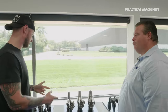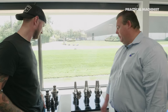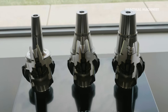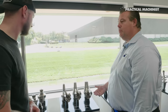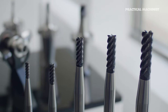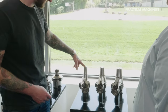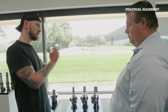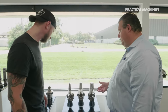Now let's look at the Power Shrink holders — the evolution of Haimer shrink fit. We started with standard shrink holders, then came out with Power Shrink which has about 30% more mass by design to dampen vibration. Then there's the heavy duty shrink fit holder with twice the mass, meant to provide maximum gripping torque when getting into super alloys. Looking at the cutaway — that's where the tool goes in, and that's where your taper goes. Heavy duty is for hogging a ton of material without vibration.